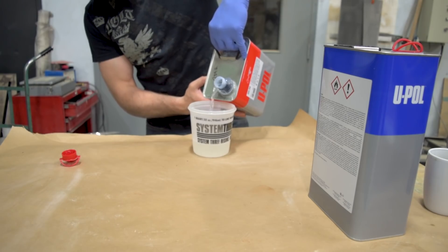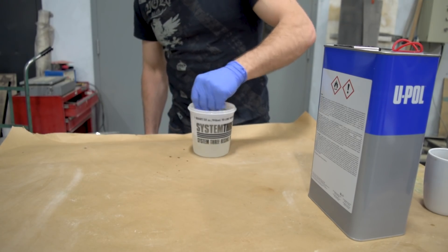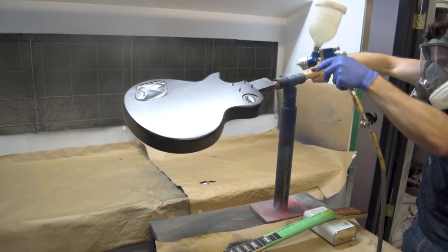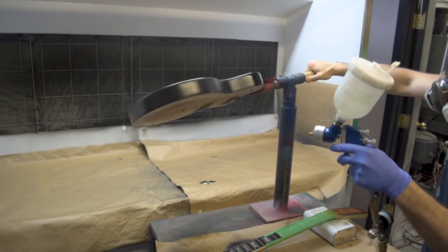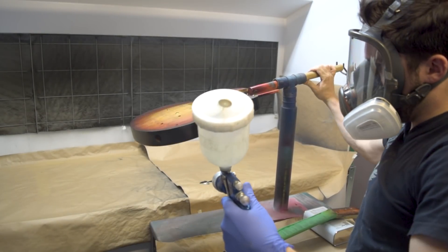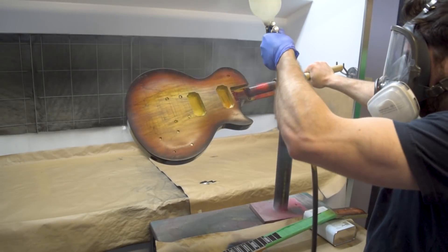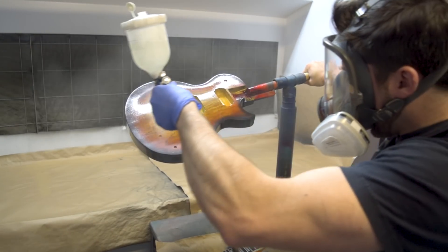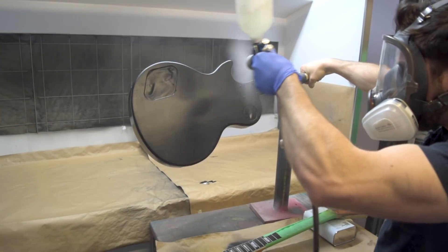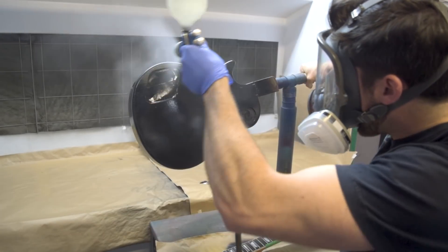I didn't put a clear lacquer on it because I'm going to come in with my U-Pole 2K catalyzed polyurethane to get a more durable and harder finish, and also an easier gloss. The lacquer is easier to spray and easier to repair, but this stuff is going to cure rather than just dry — within a day or two it gives us that fully hardened automotive finish that will keep this finish nice for as long as possible. It's a little more difficult to polish than lacquer, but I think it'll be worth it. This is a three-coat finish; the first one goes on relatively light — we call this a tack coat — to allow the other coats to stick better.